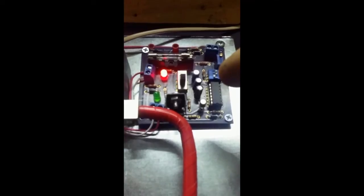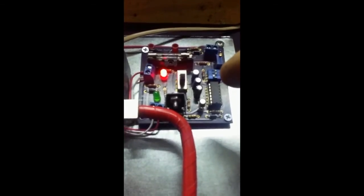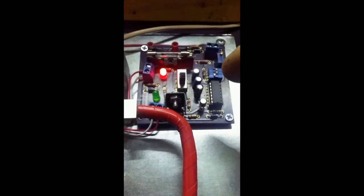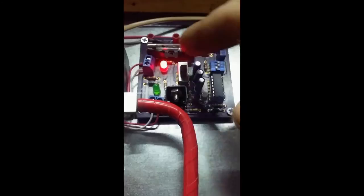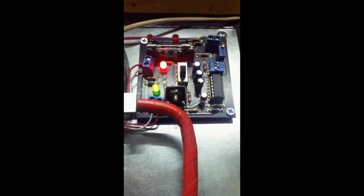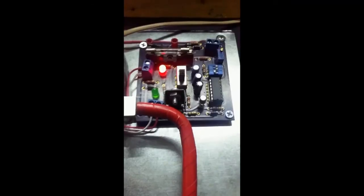Over here you have three dip switches which are time delays. The first one's set for maybe five seconds. The second one can be set for maybe three. And the third one can be set for maybe two. I'll turn it on — now I'm going to shut it off. This is number one delay. You can see the green light when it's activated, and it shut off. If you heard the click, you can notice how quiet the relay is.